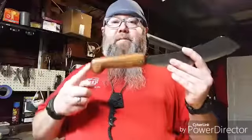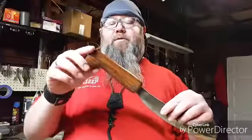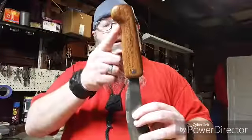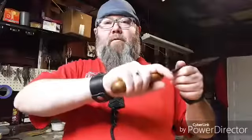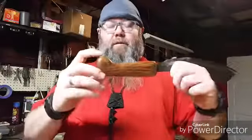After all that I took it to the belt sander and shaped it down roughly to something similar to this shape. The problem was certain areas were just too out of reach for the belt sander — the circumference on the ends was just too wide and I wasn't happy with how it was looking. So I decided to take a Dremel and get deep into this curve here, not only here but on the sides, to give it more of a pistol grip kind of feel so my pinky or the end of my hand could fit in there nice and snug and I don't have to worry about it slipping off because of the knot.